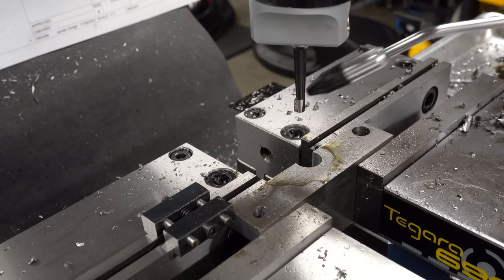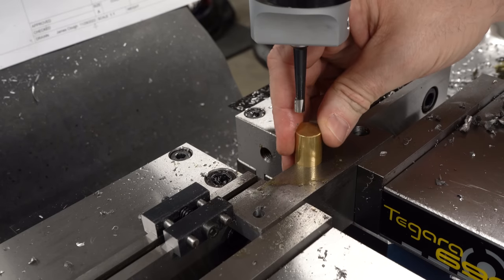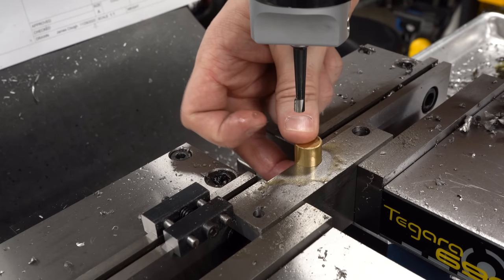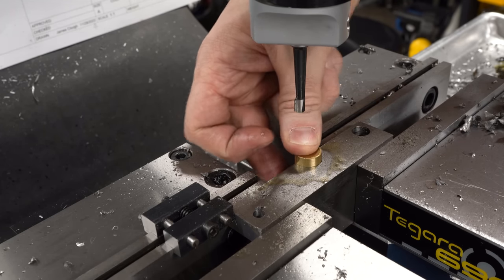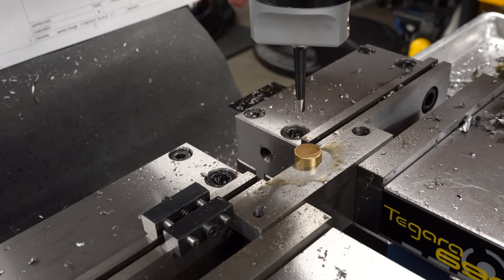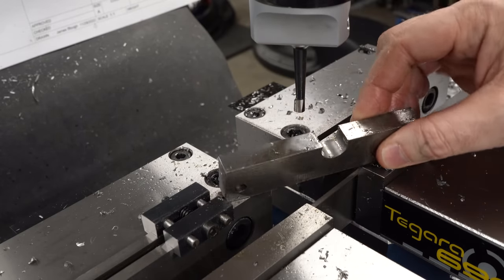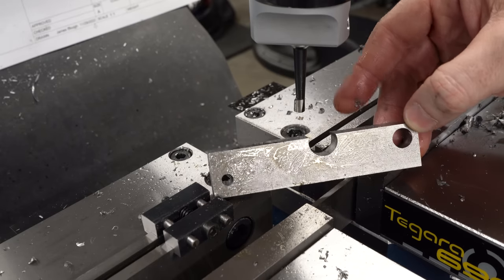Let's try it with the actual piece of brass that needs to fit in there. The brass is nominally 0.625 but actually measures about 0.624, so we've got about two and a half thou of clearance - a little more than I would prefer. I really wanted a thou, maybe three-quarters, half a thou, just to have that buttery smooth precision fit. But it's not really needed. Nobody is gonna know about this as long as I don't tell anyone and you don't tell anyone.